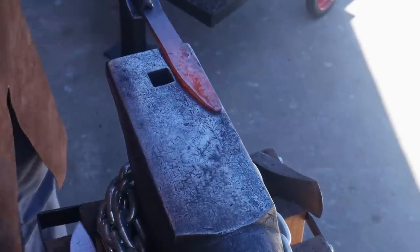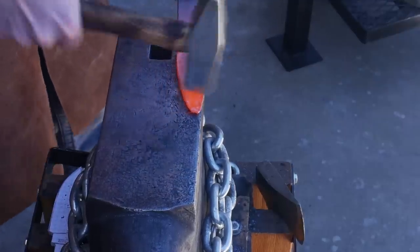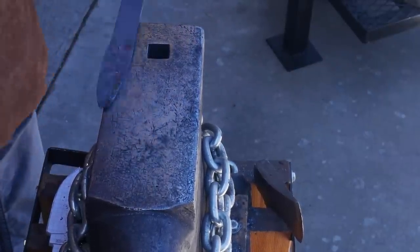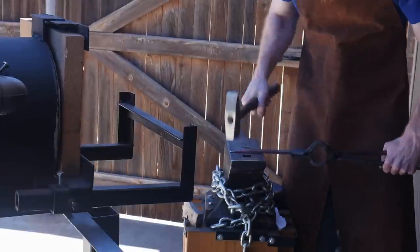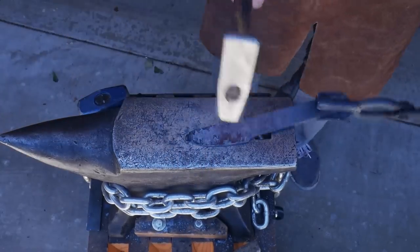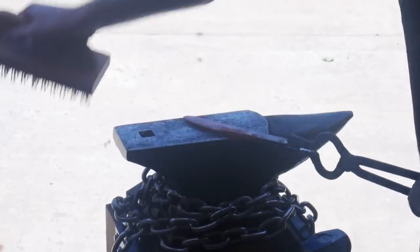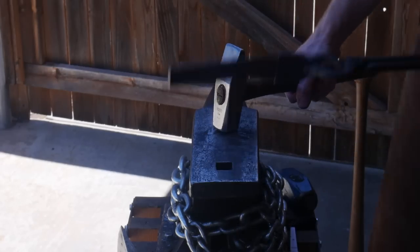The things you see me do here may not be the most efficient — I take a lot of heats to get this blade to the shape that I feel is good enough to start grinding on. What you notice me doing here is starting to forge in my bevels, bringing the blade to the edge of the anvil and hitting it with some glancing blows with the hammer coming off the anvil. This is drawing my bevels in and also adding some curvature to the blade towards the tip, which is why you see me trying to get it straight again.